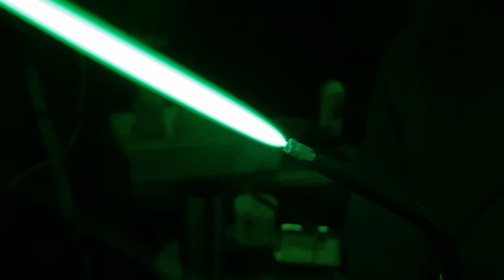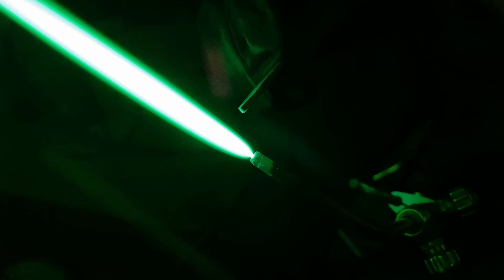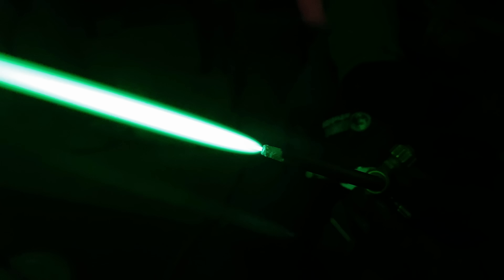When I'm silver soldering I need a very small cone. The tip has a little orange bit — that's carbon on the tip — and the cone itself is not very sharp. So you can take a small file and do this — that should make a sharper cone. Some people probably think that's terrible but it really works.